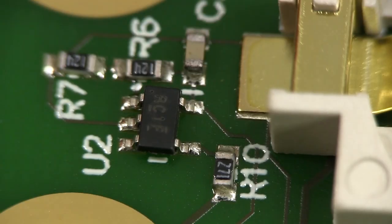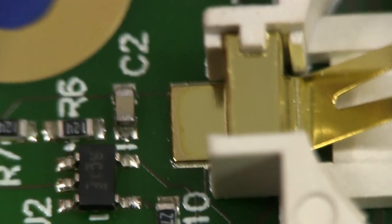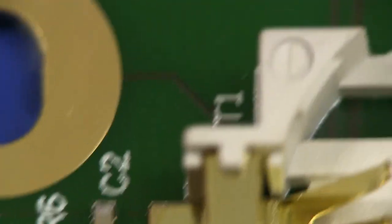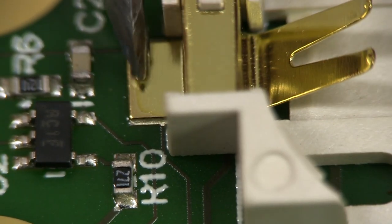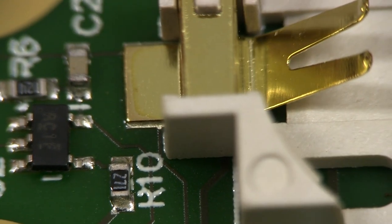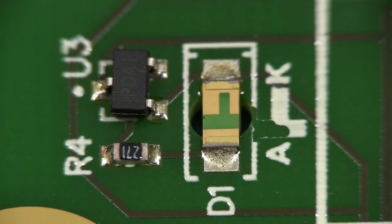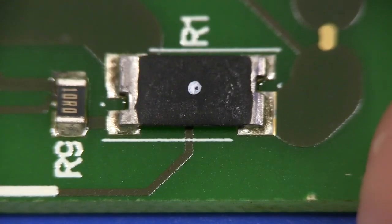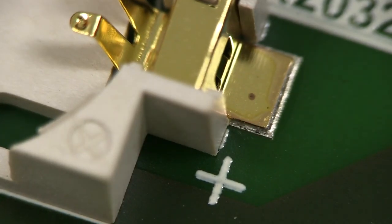No problem whatsoever. Even the larger thermal mass battery holder there looks like it has reflowed on the edges. It's hard to see because the pad of that is not much bigger than the tab itself. So that's the recommended footprint. And the reverse lead there. Let's check out our main current shunt resistor down there. That looks really nice. Not a problem. That, folks, is a winner.